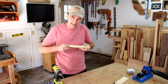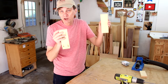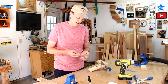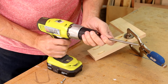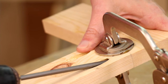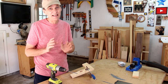To join the boards they need to be clamped together while driving the screws. If you don't, the twisting motion of the screw will shift them apart and they won't be flush. For joining together flat edges like for a picture frame or the face frame of a cabinet, I use this clamp right across the joint to keep the boards in place. These are square drive screws and one of these long drivers makes it easy to drive them. Set your drill to a slow speed. I usually drive the screws in by feel, stopping just when I feel them tighten. Be careful you don't drive them too fast or with too much torque which can cause them to blast all the way through the wood. For that reason, I also don't recommend using an impact driver.